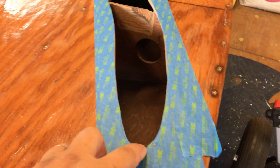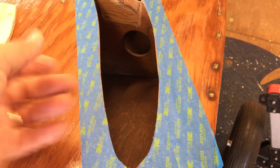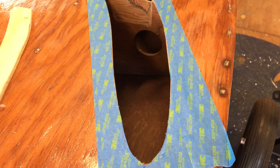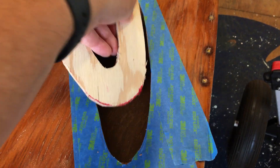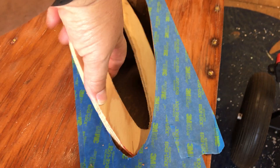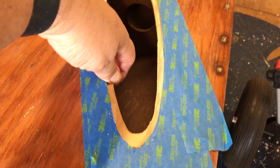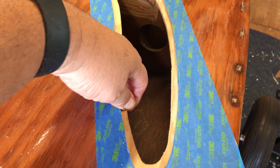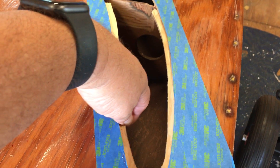It's also good for a blind patch repair — where we can't access the hole other than from the hole we're working in. So we take a little bracket, a little backer plate, and it's going to go inside, just a little bit bigger than the hole. We're going to glue this in place, and then that becomes the shelf that the plug is going to rest on.